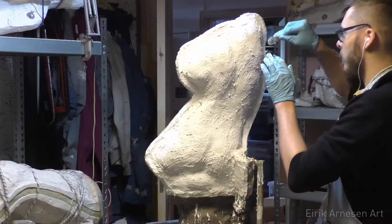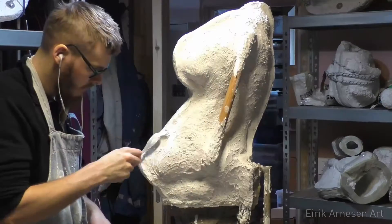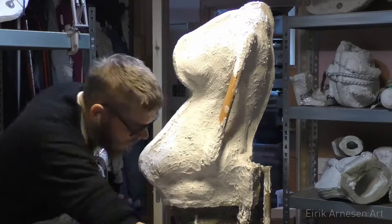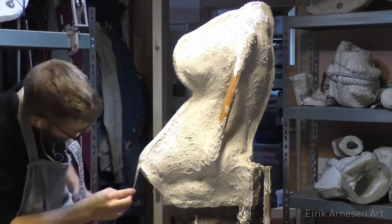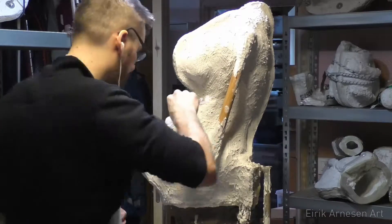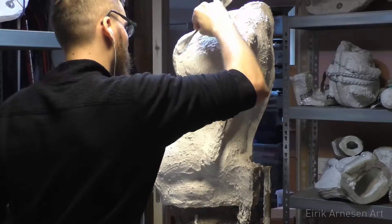I only do one layer and that's kind of enough for this. Then to build up a bit of a stronger edge where the mold is going to part — where the mold meets up with the silicone wall from the last episode — I take a bit of a thicker mix. Once the aqua resin reaches a cream cheese kind of consistency, I build up this little extra wall to give it more strength. There's also a wooden pole fiberglassed in at this point; you can use aluminum or anything else.